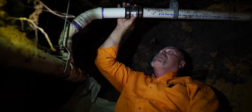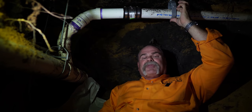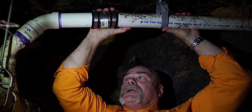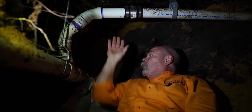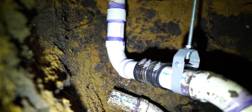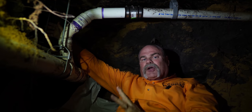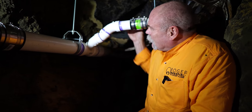The last thing we want is when the backfill crew comes in for them to move stuff around. That's what we put shear bands on for — so it cannot offset. And that's what we put the hangers for. We literally drill up into the bottom of the slab, put a clevis hanger, and sink an anchor up into the slab so it won't move. Now these lines literally are not going anywhere, no matter what happens when they put the dirt in.